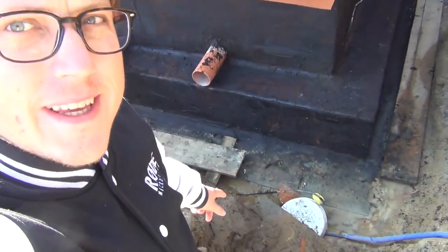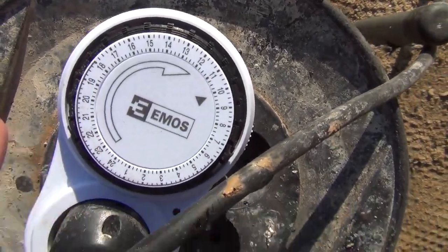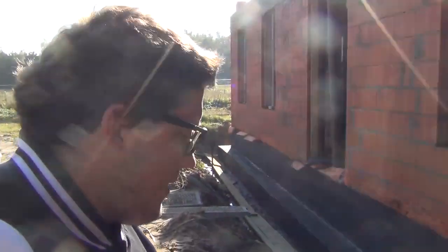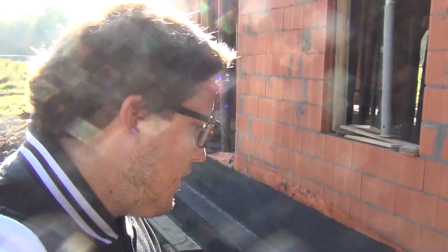As you can see, a pump is running. I have a system of two pumps set up at the foundation, running on a timer — every hour for 15 minutes. Each notch on the timer is a quarter hour. They just turn on disregarding the water level. These pumps are good construction so they probably won't burn out running dry, because they have a big chamber where the engine is housed and water keeps spinning inside, keeping the engine cool. They've been running like this for about four days.